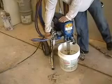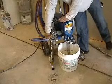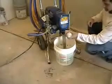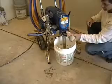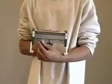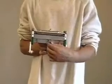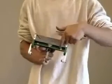After the tubes are cleaned, allow the pump to cycle through the relief valve for 5 to 7 minutes to finish cleaning the pump. Follow the pump manufacturer's recommendations for lubricating the pump after each use. Also, there is no lubrication required for the coaters. Just make sure to remove the access cover when cleaning to remove compound from the coater cavity.